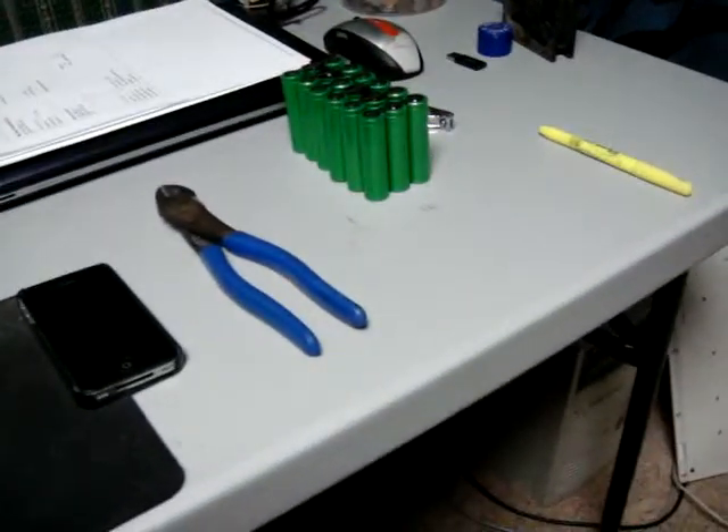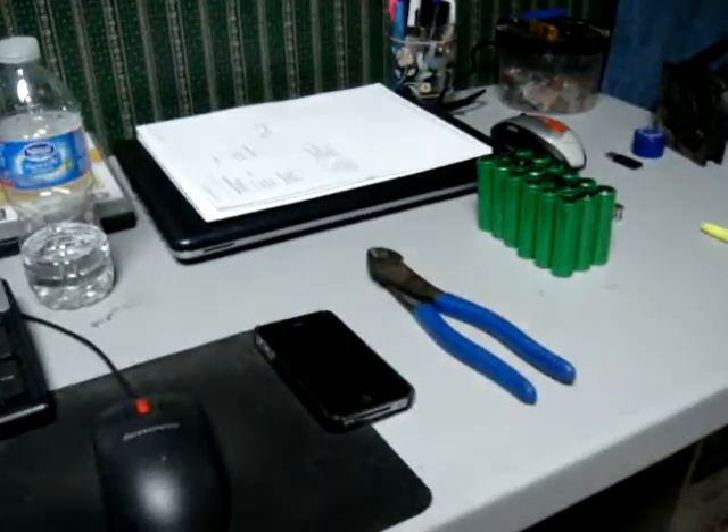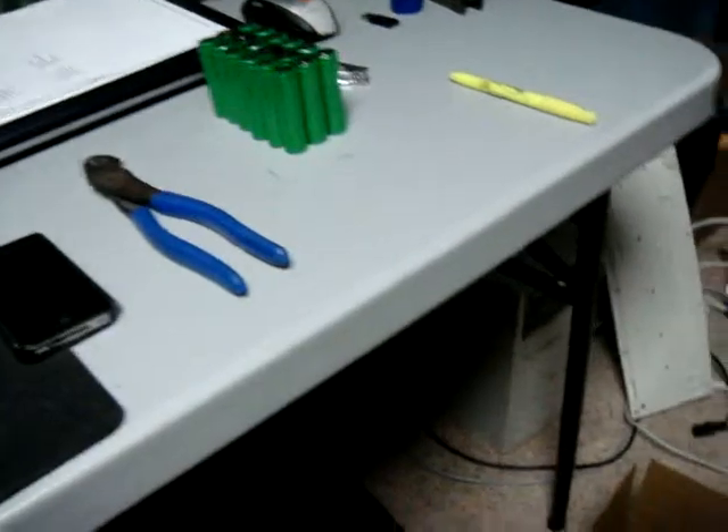What I'm going to do here — what my hopes are — is to completely disassemble all of these batteries. I'm going to build a 72-volt battery pack. I'm actually going to build it into two 36-volt packs so I can charge at 36 volts and then put them in series and power them on the bike.